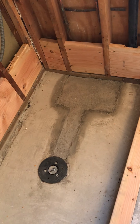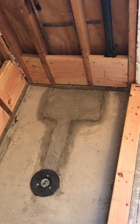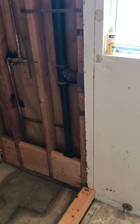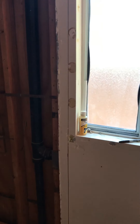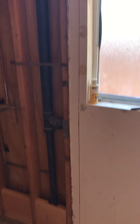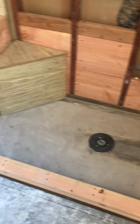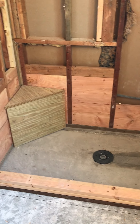Inside the shower I've got about a finished area from tile to glass of about 32 inches, so that's plenty of room. It's kind of pushing it a little bit for the toilet, but you've got to work with what you've got. I left that section of drywall because I need to tie into that corner — I don't want to lift that off. All of that will get thoroughly waterproofed with the backing I put up and then obviously the shower pan when it gets connected. Next phase: it's time to call the shower pan guy — he should be out in a couple days.